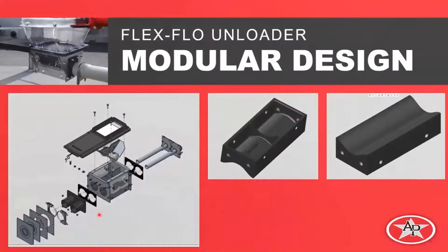Here's an exploded view showing all the different components — tube anchors, gaskets, anchor bearings. This is the wear plate I was referring to. You can see the wall thickness is much thicker with a very uniform design. The alignment is going to be as precise as possible because this surface is made exactly to the tube anchors, so there won't be any wear points working against the auger like we might see on some of our steel unloaders today.